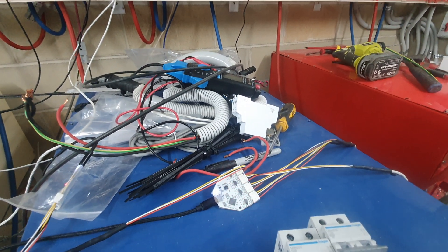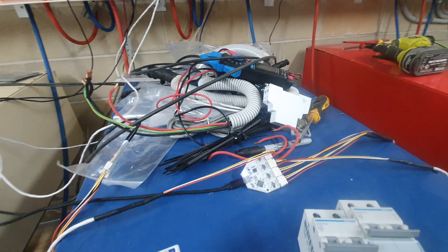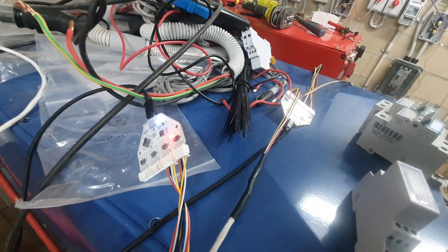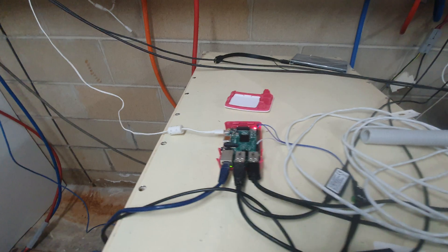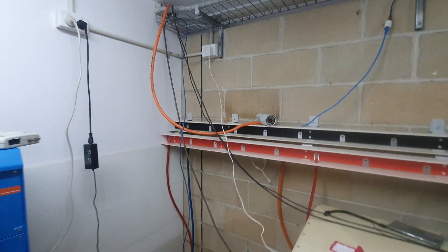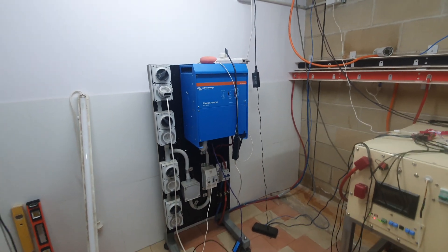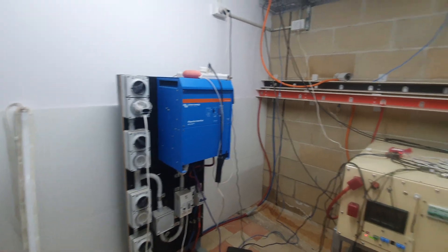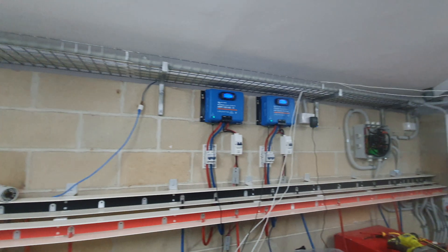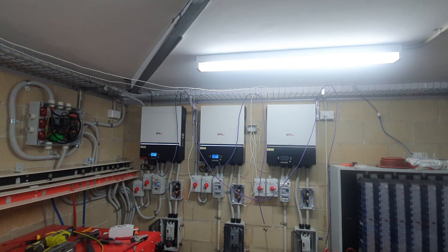I'm pulling data out of all these Victron shunts. At the moment there are seven shunts to be eventually wired up — I've got most of them wired up, and you can see the data being pulled from each one with the little flashing lights, going into a little EmonPi. It's all looking quite all right. I'm also going to put a little 800 watt 48 volt backup — I'll mount that against the wall into the bus bars, so if I want to shut things down I've at least got power in here as an emergency while I do work.